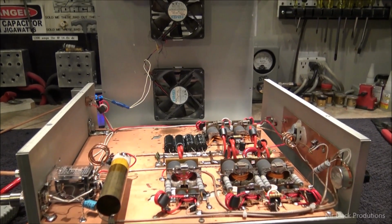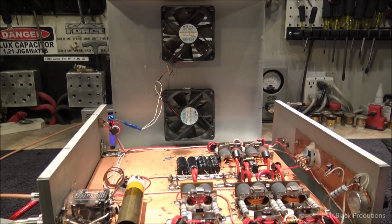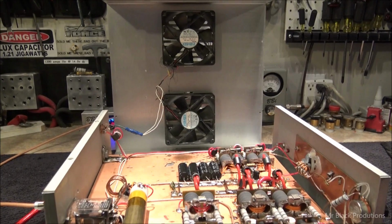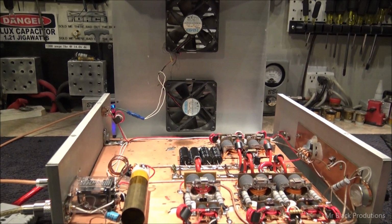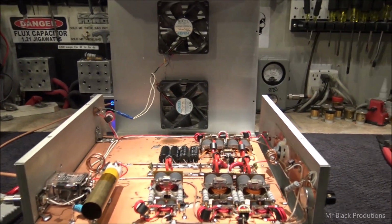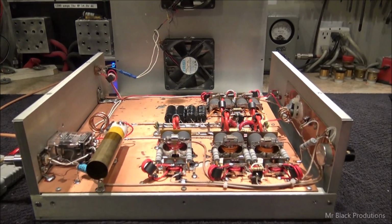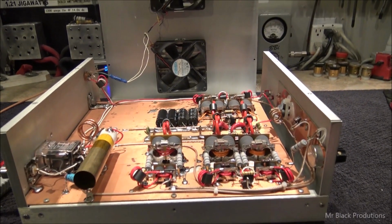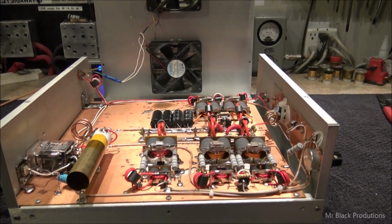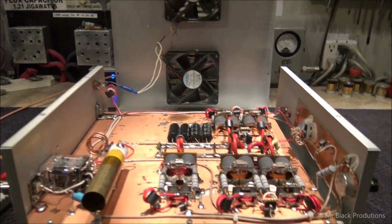These are the super high flow, high velocity, make lots of noise, make the grates on an X-Force cabinet scream fans. So they've got to be loud. There's a lot of heat to get rid of. I've got one over here where the fan quit on it and the guy kept talking on it and it caught on fire because everything got so hot all the solder melted and shorted. So fan noise is annoying, but in the same breath it keeps your amp running good. So let's put the tin on it. Let's get on with the testing.